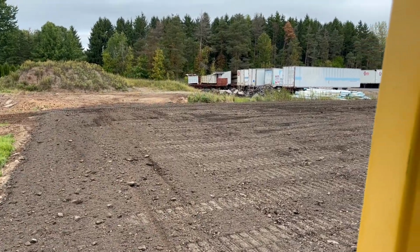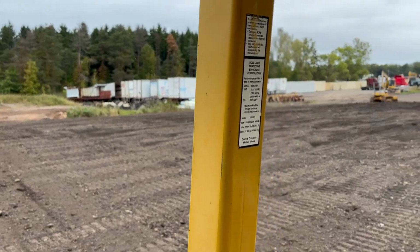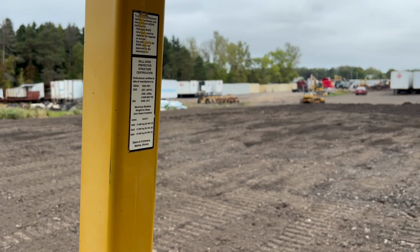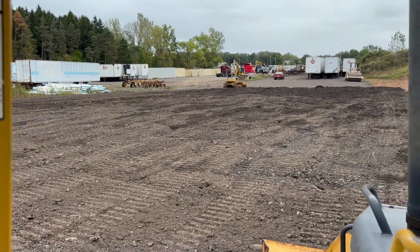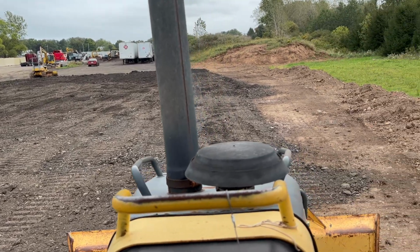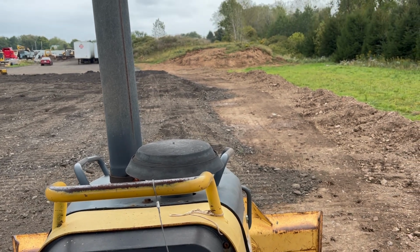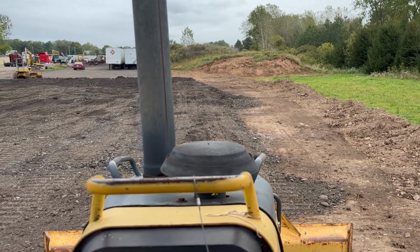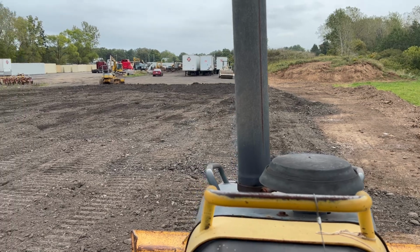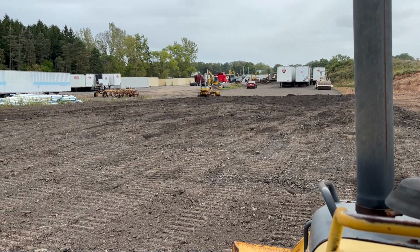All right, guys, so over there, probably about 8 or 9 dozer blades worth of passes. We have finish grade the rest of this. I just went ahead and rough graded in. This dozer, it's a John Deere 450H. It doesn't really grade all that well. I think if it had longer tracks, it would probably be a little bit better. But we're using that Komatsu D21 over there to actually do the finish grading.